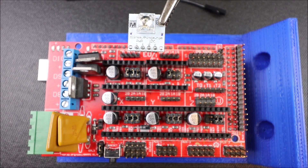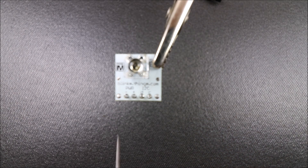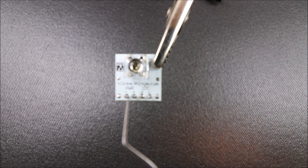In a moment I'll show you a close-up of the Blink M so you have a better idea of what the pins are. Underneath here you can see the pins. We have our negative pin, our positive pin which is the voltage pin, and this is ground. Then we have the pin labeled D which stands for serial data, SDA. Then we have C which is serial clock, known as SCL.